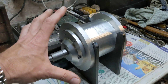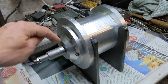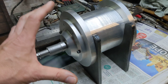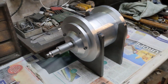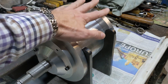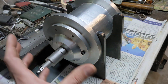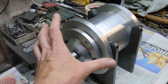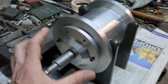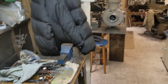The nice thing about that is if we keep that setup we can set up the entire gearbox, check that it works, and check the clearances because you'll be able to see what's going on. We can do a bit of a video at the end showing how the gearbox functions when it's complete, which I think would be quite interesting. The gearbox itself is sitting on the gearbox plates - obviously rotated 90 degrees as that's a nice way to hold the gearbox firmly on the bench. They still need to be drilled and tapped once we've decided where it's going to be in the bike, but we really need the bike frame back before we attach this to these plates, so we can fine tune the orientation of the box in the frame.